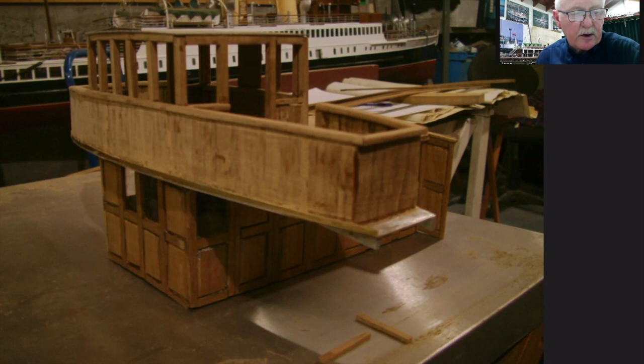The KG5 has a radio receiver in the wheelhouse to prevent signal blocking by the aluminium hull, which makes for long cable runs. For example, from the rudder servo to the bridge is 12 feet and from the engine room it's 6 feet. The receiver battery is housed in the life jacket locker behind the wheelhouse and can be easily accessed from port or starboard when afloat, when switching on or off. And she has a main isolator switch under a hinged thermofan box in front of the mainmast.